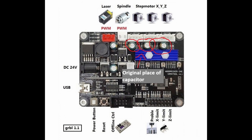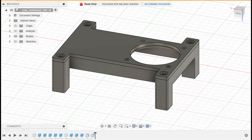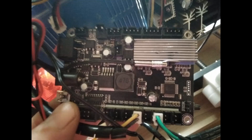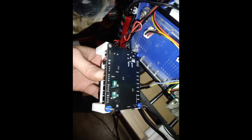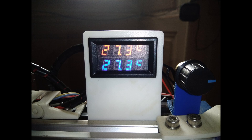To not exceed the limit of the new stepper motor, I set a current of 1.2 amperes. I also modded the mainboard and created a new case for it with Fusion 360. I added a new, more powerful fan and a new heatsink with more surface area and a thermal pad. I removed the capacitor in front of the motor board and switched it to the back, which gave me more free space for the new heatsink. To monitor temperature I added a probe.